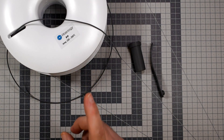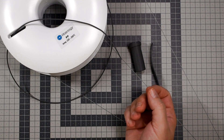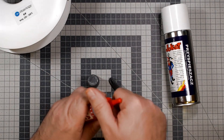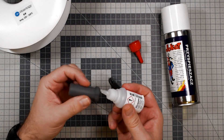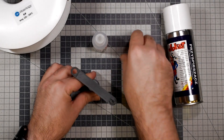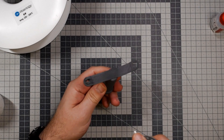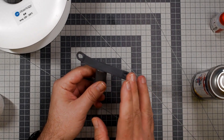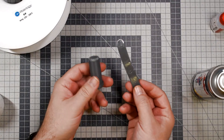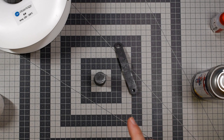However, printing with polypropylene is not simple, not easy, and requires you to have at least a few challenges solved. Problem number one is that polypropylene does not stick to anything other than polypropylene. For example, I have some CA glue — let me put some on this 3D printed piece and press them together, then apply accelerator. If this were PLA, both parts would be really stuck together for eternity. With polypropylene, look what happens — it just separates with almost no resistance. It's super hard to glue polypropylene to anything that is not polypropylene.